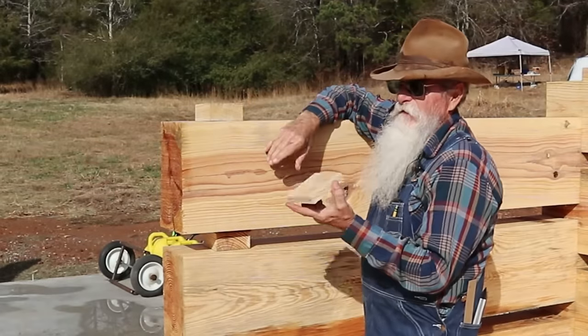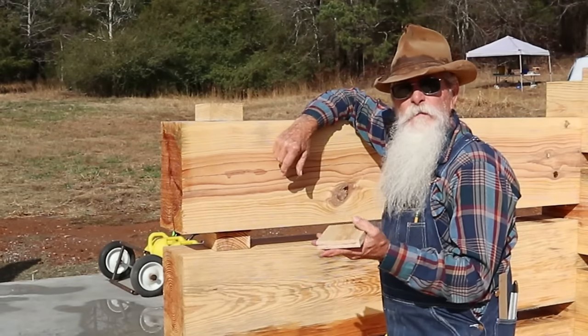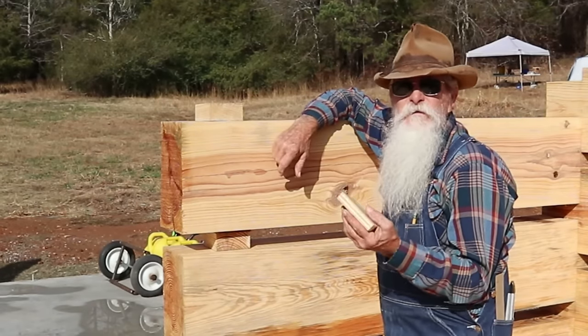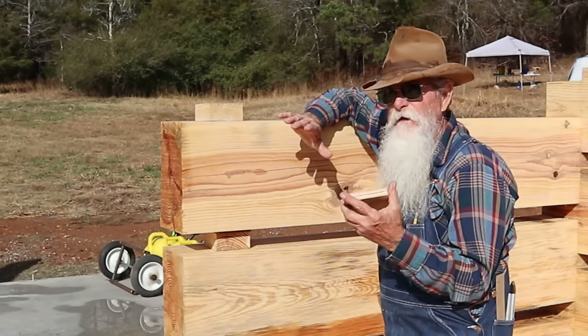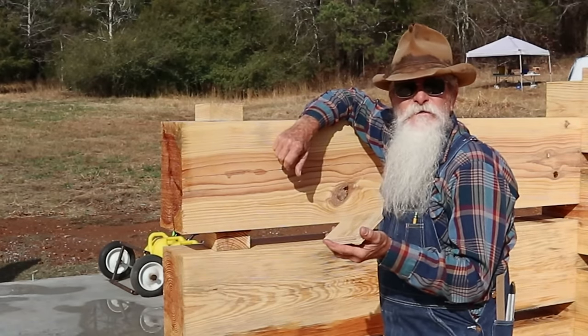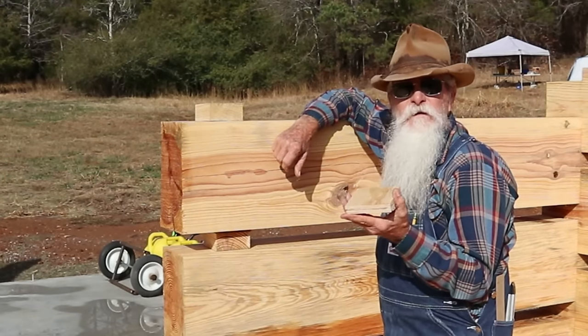And what I've been using is just 3/4 inch plywood. I can take my little small power planer and plane it down to exactly what I need, and that has really made it nice. I'm not having to carry a bunch of different thicknesses of shims like I do when I'm working live edge. This has really been an easy way to go.